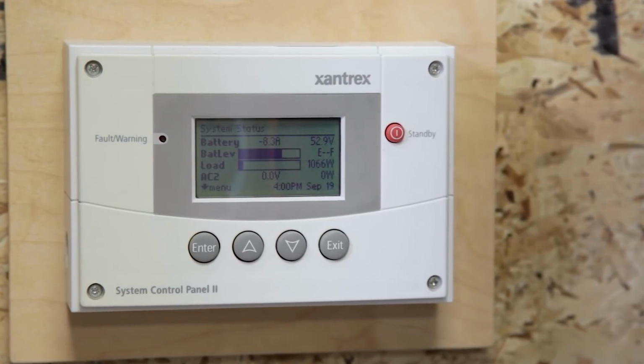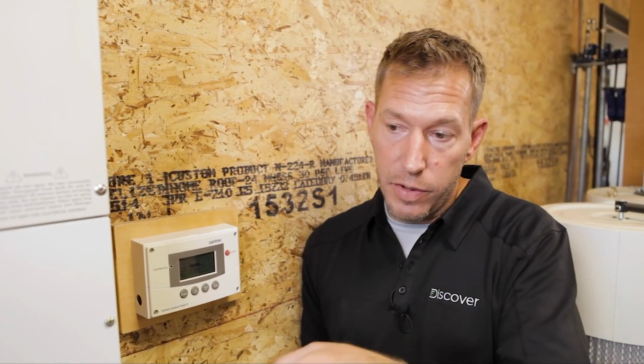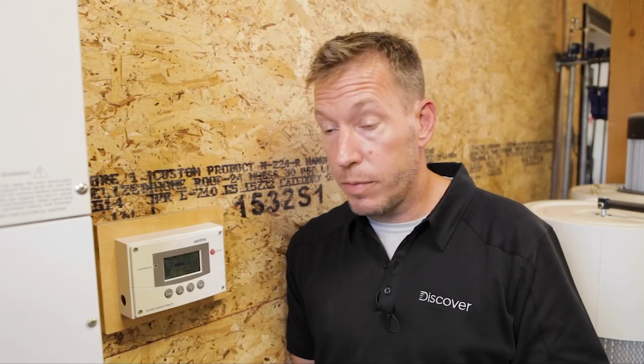Okay, so at startup there, it was 275 amps DC pulled out of the batteries. That's essentially the continuous rating of 2 of them. It didn't stress them into going into inrush mode at all. Anyway, there's your quick demonstration of the battery setup with open loop communications, and next up is the closed loop.